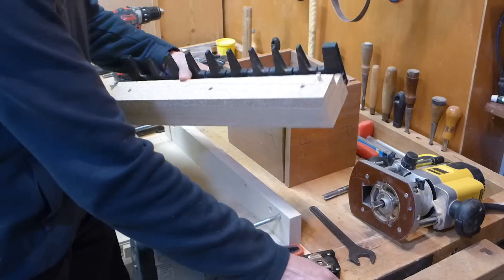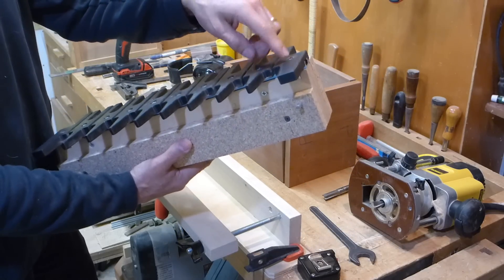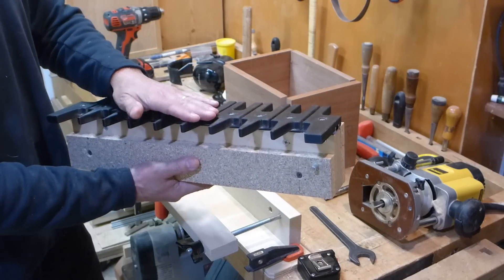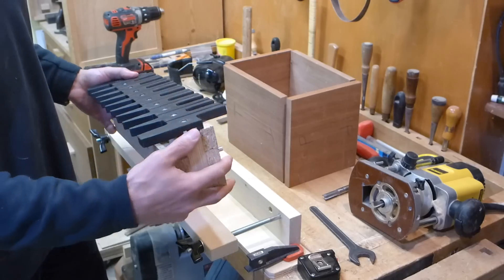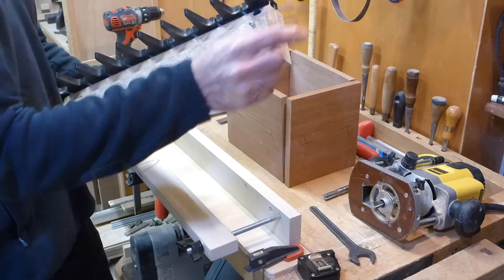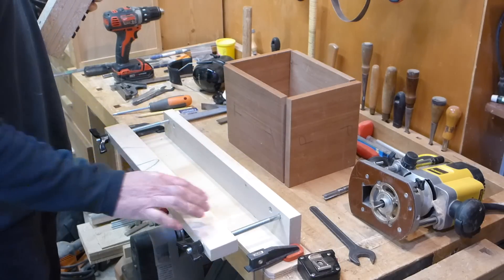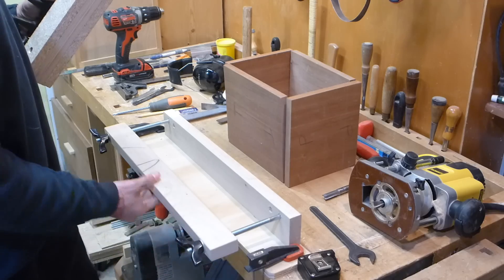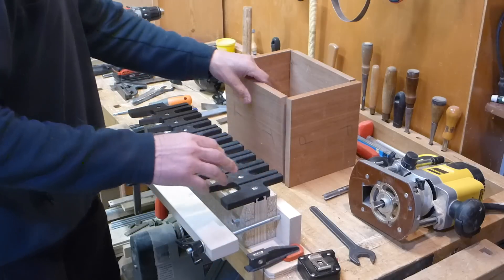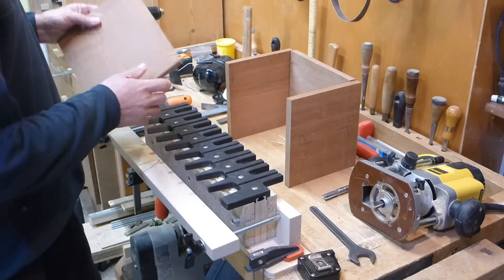The T-track is mounted on short sections of T-track at either end. There are screws I can reach through when the templates are removed, and I can move that track back and forth to adjust the fit of the joint. I've got it set up right now for a nice snug fit, but I can adjust it to introduce a little more play or make it tighter. There are also stops for aligning your stock, and the base has a 3/8 inch carriage bolt with a clamping bar on the front, making it easy to put stock in place, align it, and lock it down.